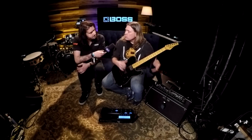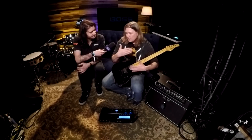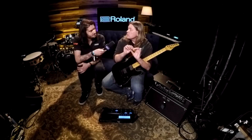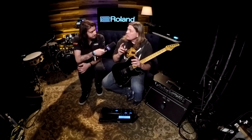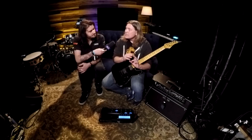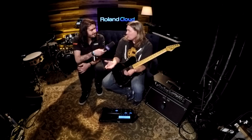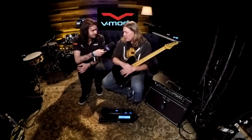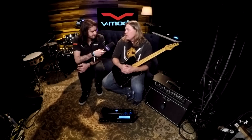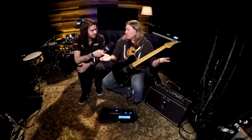On the back you'll instantly see the big green speaker, the closed back on it, but there's also a speaker jack so you can remove it and plug into other heads. A thing I really love is that there are two 16-ohm jacks on there. It has the normal 8-ohm, and you can use two 16-ohms because the most common 4x12 you walk into at any gig or rehearsal room is 16 ohms. Most heads can only power one of those, so we wanted to be able to plug into two.